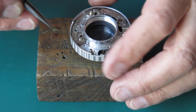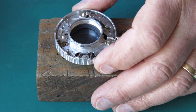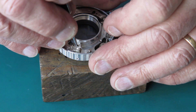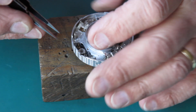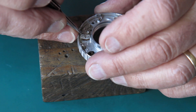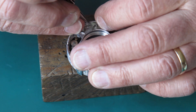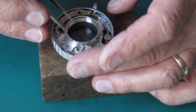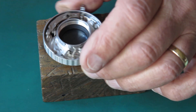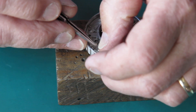I need to put the flash contact back into the shutter. First that brass plate goes in and then the flash contact post. This is some sort of styrene type plastic — it's very fragile. If you get solvent anywhere near it, it just turns to spludge, and it's almost always somewhat split and stretched, so it doesn't want to go back into the square hole it came out of.